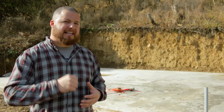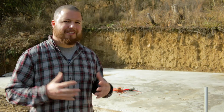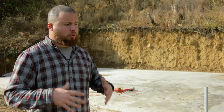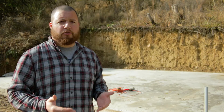So what is a relief cut? A relief cut is a cut about an inch or so deep in the concrete at regular intervals. What it's supposed to do is control where that concrete is going to crack or break, because it's inevitable. This is such a hard surface over a large area with the freeze and thaw of the ground around it — it's going to push it up and heave it and it's going to crack. We just want to control where that crack happens.